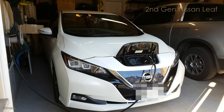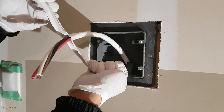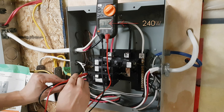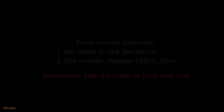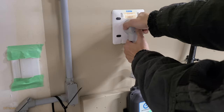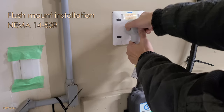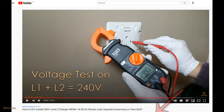If you have watched my videos before, you know we had a Nissan Leaf and I installed the 240-volt receptacle for the level 2 charger about 4 years ago by myself. You should check it out if you have not installed one for your electric vehicle — it's not too difficult at all, there's no need to hire an electrician. Using the mobile charger that comes with the vehicle, there is no need to rewire when you switch from one EV manufacturer to another because NEMA 14-50 is the standard. Just plug and play. Check out that video if you are interested; I will post the link in the description.